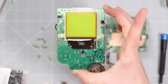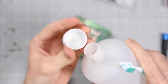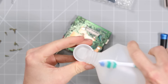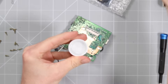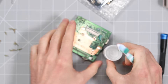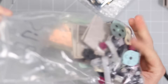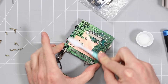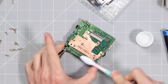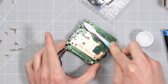Wait — I'm being a dum-dum. This old screen I do not need anymore — completely forgot about that. I'm back. I've cleaned all the buttons. I have something to report: the D-pad button membrane had broken — all of the little raised bits had just broken off. But I found a bag of spare parts that I have. For now, I'm going to give this motherboard a quick clean with some isopropyl alcohol and a toothbrush — give it all a nice old scrub so it will hopefully last for many, many years to come.